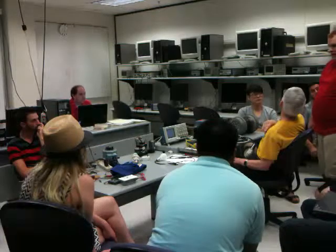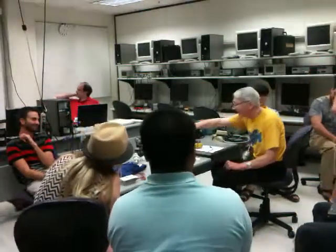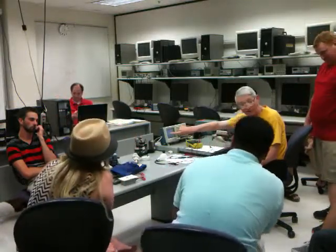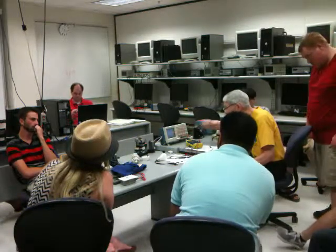You know how to use cursors to figure out the angle. All right, so there I've got the fine line and the thick line. One goes on 0, the other one is over there where it's about crossing 0 now. And if I look right here, it looks like 3.8 milliseconds. Can you calculate that in degrees?